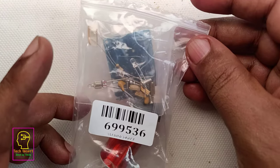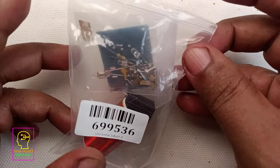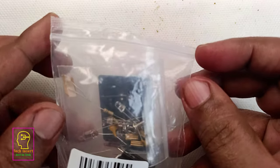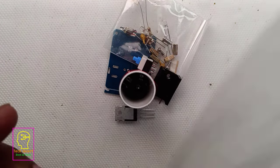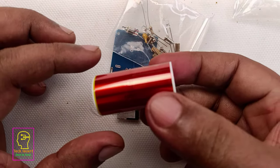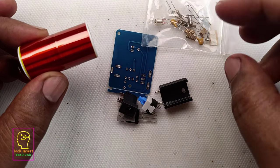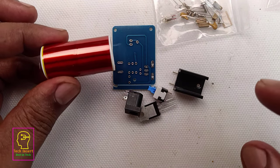I designed my own Tesla coil circuit, then assembled it, and while testing it failed a couple of times. Then I thought of buying the kit from an online store and then assembling it. Each and every time I was testing my own circuit, the transistor was blowing off. Mostly this is because of the choke or the coil. The kit is very cheap, and I will give the buying link in the description box.